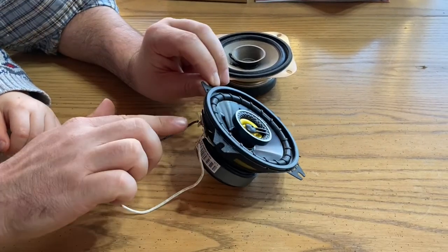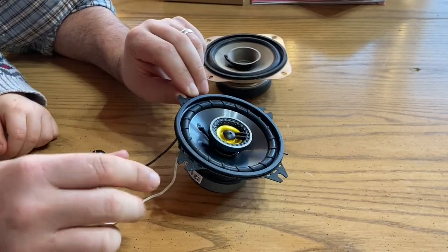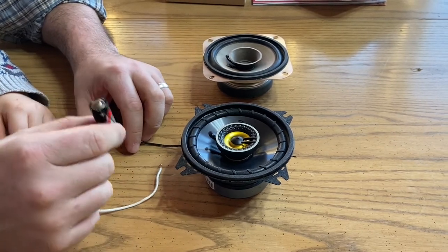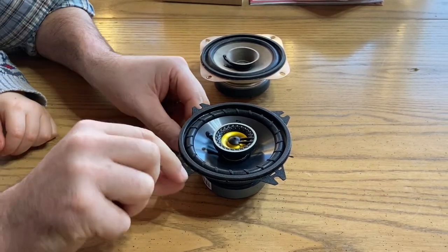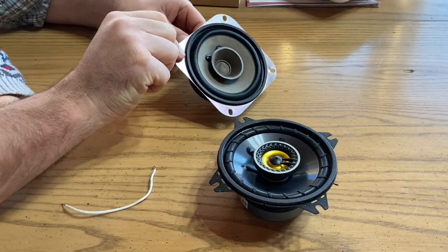All these speakers have two spade terminals on them, one small, one large. It's to control the positive and negative circuitry. And that's a quick and easy way. Any battery from a AAA up through a 9-volt can be used to test these speakers. And if you get a problem speaker, which we'll demonstrate with this guy,